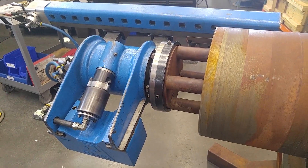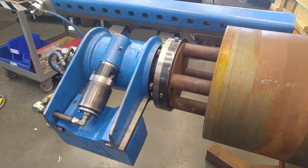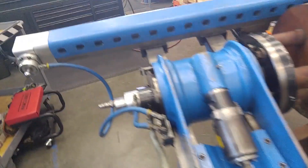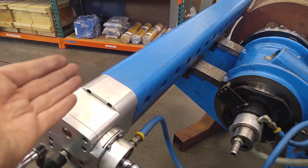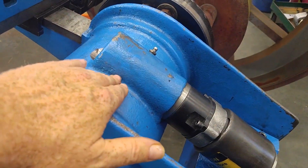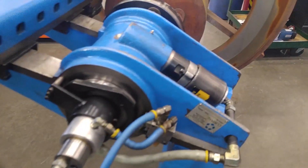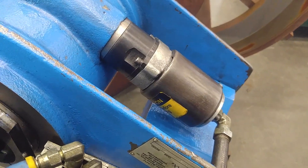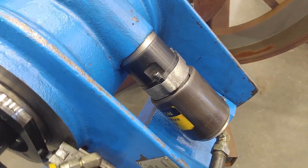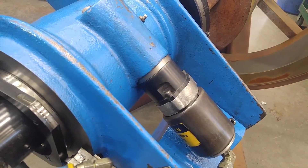We've got the machine mounted up onto our assembly test fixture here. In most cases in your workshop you're going to have this sitting on top of the crate, on the floor, or on a workbench. A good way to test the air motor is to grab hold of the mounting hub and just try and rotate it back and forth. Here on the test stand I'm going to rotate it with the turning bar. What we're listening and watching for is how much movement there is in the bar before the air motor starts to turn — we're checking the play in the worm set and the condition of the air motor. You can pull on the arm a little bit, and you should have very little movement before the worm drive engages the air motor. Pull it a little more and you can hear the motor turn. It should sound very consistent — you should hear the vanes turning, and you should not feel any bearings clunking or gears clashing.